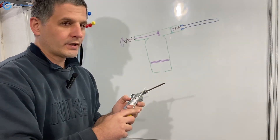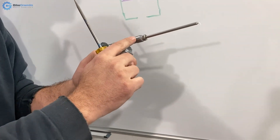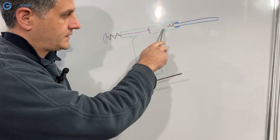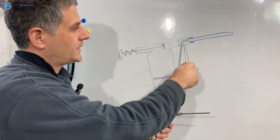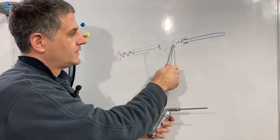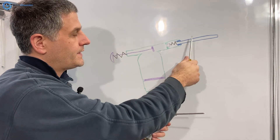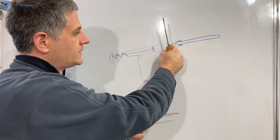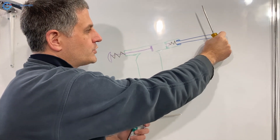However, this model, unlike the Hazet, has a small groove near the top section where the nozzle is screwed in. It's the same thread pitch as far as I can see, and I can interchange these nozzles — that's option B. But it has a small groove inside where a ball, like a bearing ball, is placed and spring-loaded against the opening when it's screwed in, and that ball is under pressure. So when I start pressing, I need to overcome the tension of this spring along with the main one for the grease to start flowing as it pushes the ball upwards and moves around the sides and through the nozzle. When I release, this ball goes right back into place and blocks the path, so the pressure cannot be relieved — and that pressure keeps pushing grease slowly out.